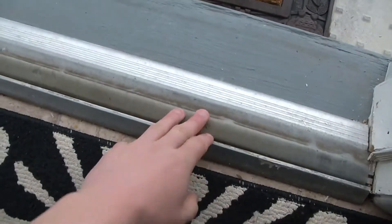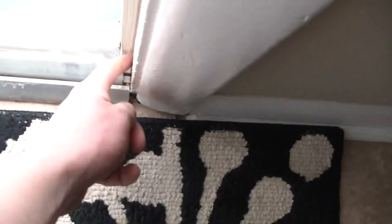I fixed our front door. Before, it was super bright and I could definitely feel air coming through there. Went to Lowe's — the old weatherstripping was really sloppy, really thick and puffy with lots of ribs on it. Cut that up nice and neat, did that, and also had some paraffin wax and waxed the bottom because the door was super slow to shut. Mission accomplished.